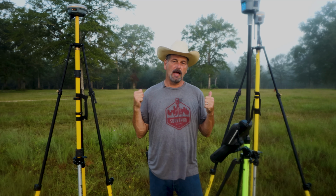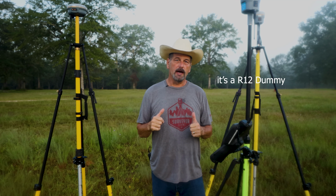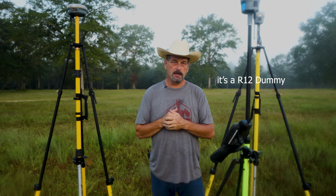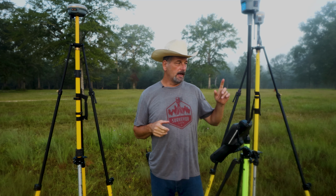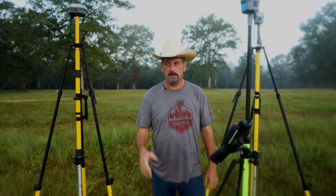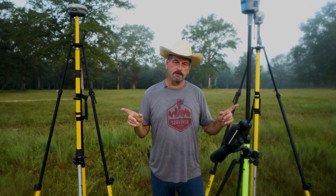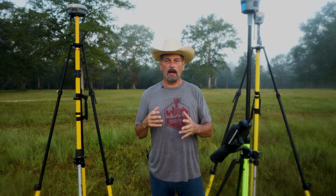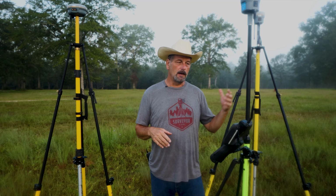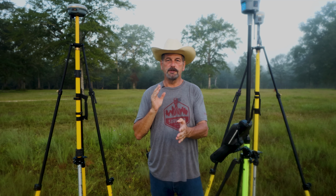Okay, so what I've got here behind me is an R10 and an R8S. My R8S is totally unlocked. It's got all the features on it that you can unlock. And I've got my R12 here, of course totally unlocked. So what we're gonna do is, I've got both of these set on the same frequency. We're gonna set up a couple of survey styles, and we're going to do what's called swap base. So with swap base, what happens is I'm transmitting from both these base stations, and then I swap between base stations to get corrections, right? So we're going to take that into the woods and see how well that works.